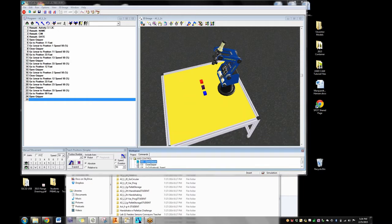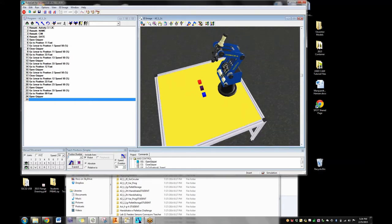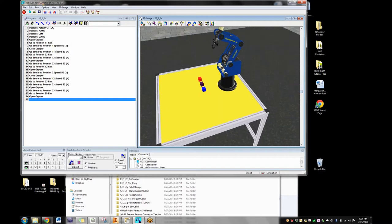In the activities, it's laid out so you open the activity and it says 'this is point 20, this is point 21, this is point 9' — and you teach or record all those points. Once you have all the positions, you can write the program and know what positions the robot goes to. All programming a robot really is, is programming points here, here, here, above, here, above, above, over here, and above here, and then the robot goes through the motions of going to all those points.